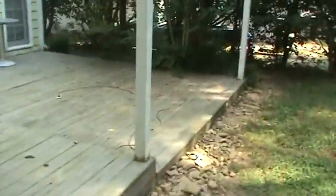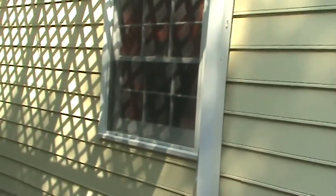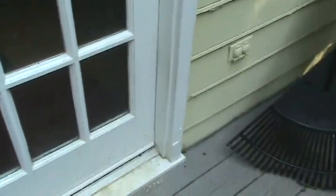At the rear deck, these are all typical repairs. He's had some good work done here — I'll show you on the chimney. He had some siding down here and you can see the condition of this manufactured siding between that rear door, the HVAC, and this rear entry door. He's got these bottom four rows right here that are shot and need to be replaced. This is smooth and beaded siding and we'll replace that with hardy plank, which is a manufactured concrete aggregate siding — the best product on the market.